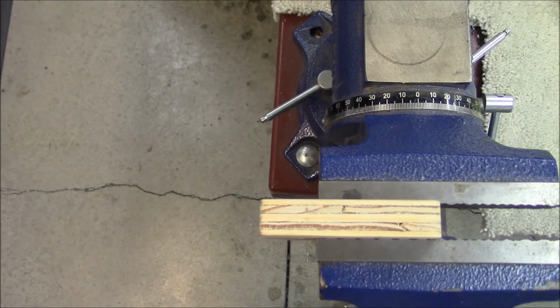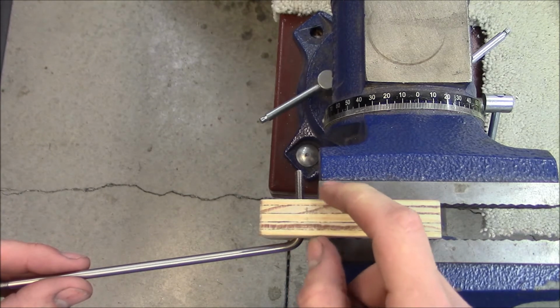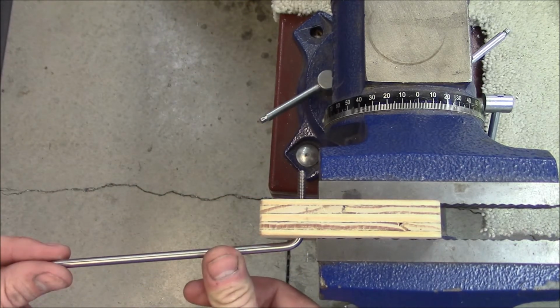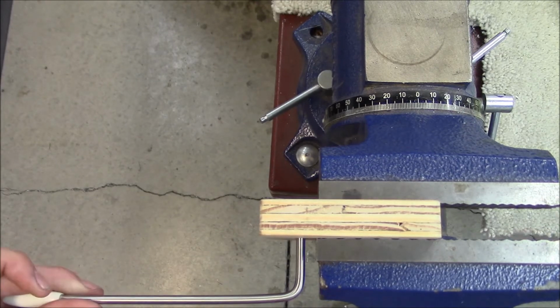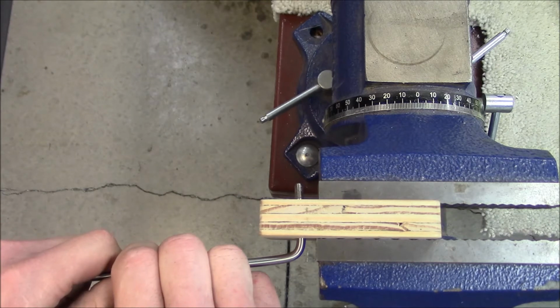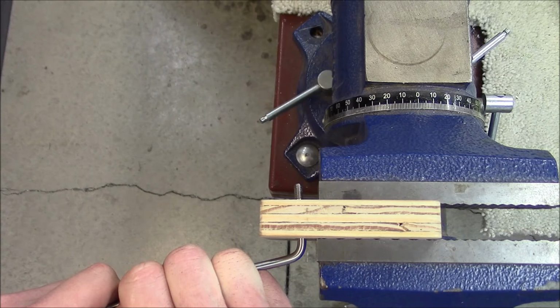Okay, so I've got our jig chucked up in a vise over here in the shop. And for demonstration purposes, I brought over a traditional threaded arm. You guys can see the reason that we're only using 3/4 inch of material is so that we get a full pass through the threads on the back side here. Now there's no risk of damaging these when we actually go to bend the arm. So I've got my overbent arm from earlier. As you guys can see, it is really overbent, and that's okay. To correct this, all we're going to do is just do steady pressure and just bend this thing out to where we see fit.